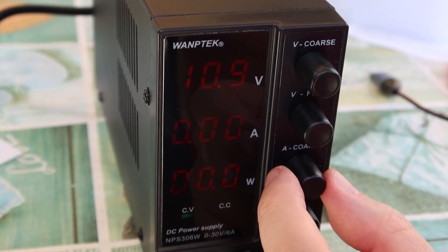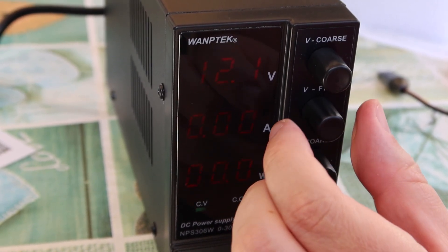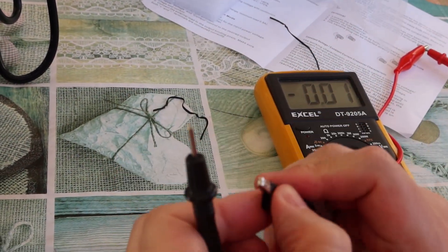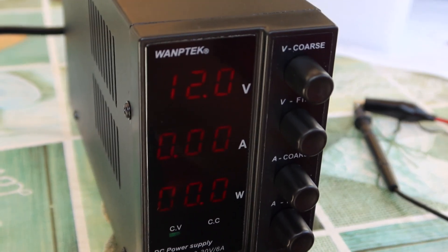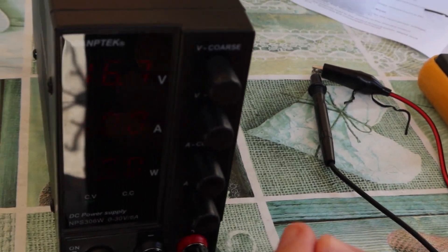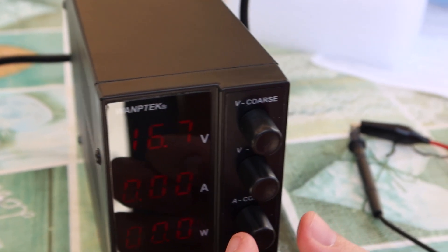It's not quite right yet. Amperes here, volts here. Oh my god, we can do exactly 12 volts! And we will check now how many volts we have. 12.3 — exactly the same... well, it's like 12.3 here and 12.0 here. Let's change it to 16... and 7... it's like 16 and 16. Yeah, fine adjustments — we can adjust our voltage.